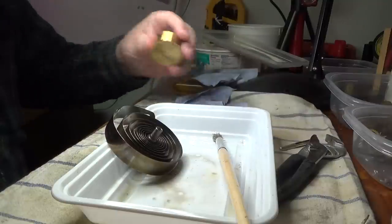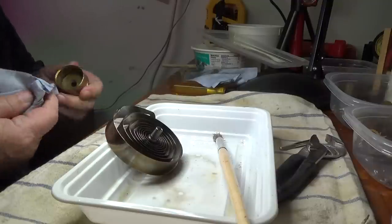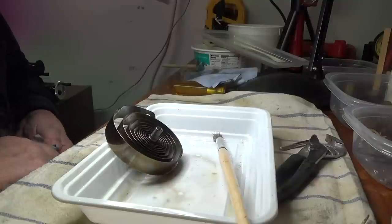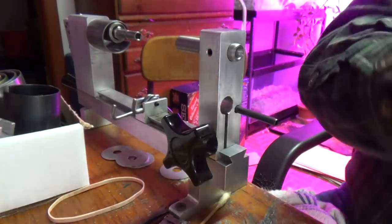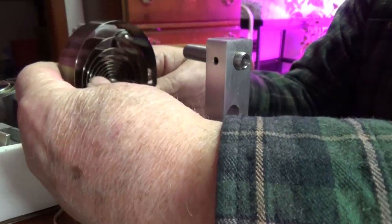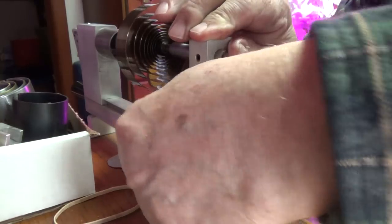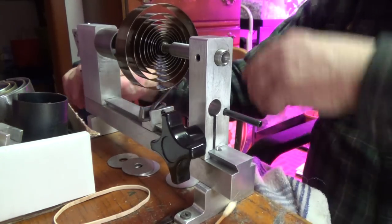And then we'll put this back into the barrel, but I want to clean the barrel first. So wipe it out good. We're going to also clean the outside. Okay, now to get this back in, I'll do just the opposite. I'm going to put the hook in here, a little loop. Put the winding end into the key. This on here, I'm gonna tighten it up. Alright, so we get the hook in, get this on here, and now we're gonna wind this spring up again.